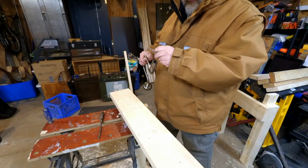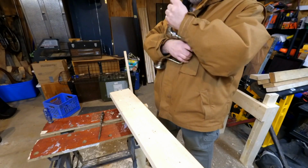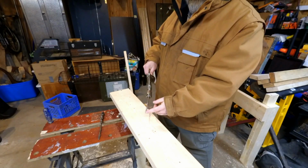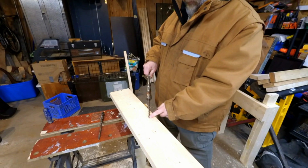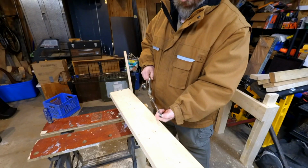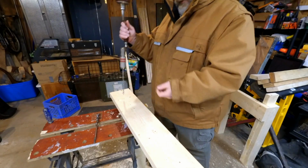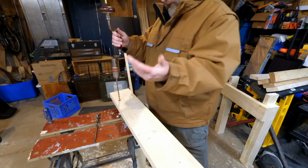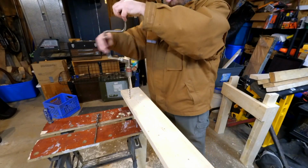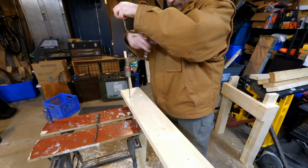You get a second bit that is about the size of your bolt. Chuck that up in the old monkey. And then this little screw bit at the end, the worm I think it's called, will just nestle into the same hole left by this one, and you have an automatic centering jig for the through hole. It's brilliant. Like that, and that's just in the pocket there. Woo! Easy. Get back over my brace. This one, and just try to keep it mostly vertical. Give her the old how you going.